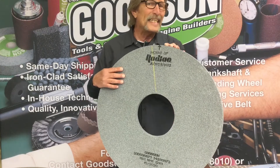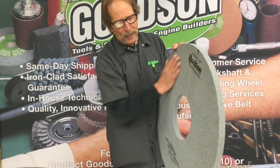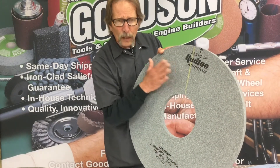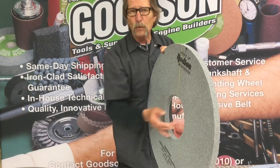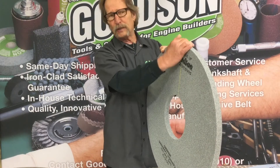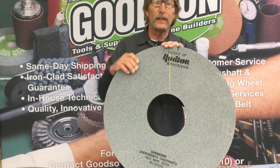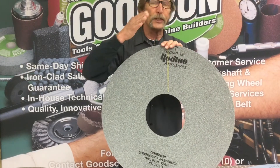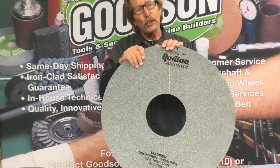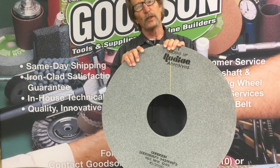We stock what's known as a T1 blank on our shelf — that's what this is. It's just a blank wheel, and we buy them from Norton and we buy them from Radiac. We stock them here in the different widths, but they're all T1 blanks — straight wheels with specific diameters, specific ODs, and specific widths. Then with all that equipment we have down there, we affect those dimensions, custom cut them exactly the way you want them. Then we ANSI speed test them to make sure they have good structural integrity, make sure that they're balanced, get them boxed up, and then we send them your way.